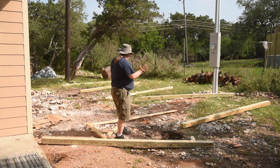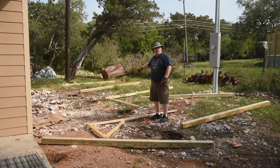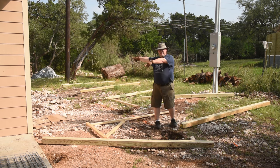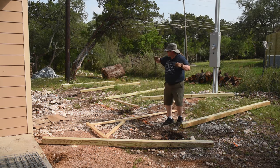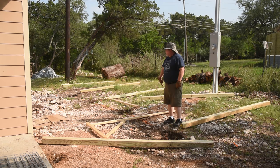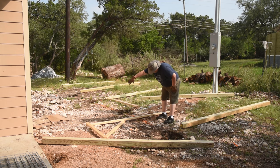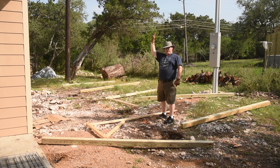Now, I know the panel size that I want to be here, and I have four panels. So if I set the outside corners first, get them locked in, using my square, come out 90 degrees to set those two far corners, well, I can wrap a string around all of it on the bottom and top. That will allow me to get my spacing coming this way and up top and get this plumb all the way down. That way I only have to worry about the left and right.